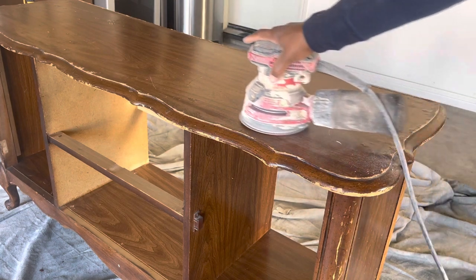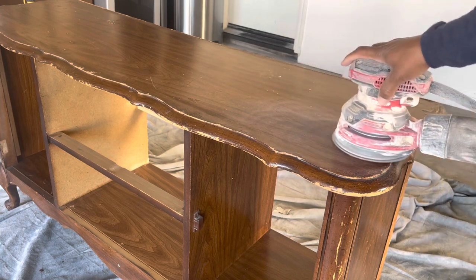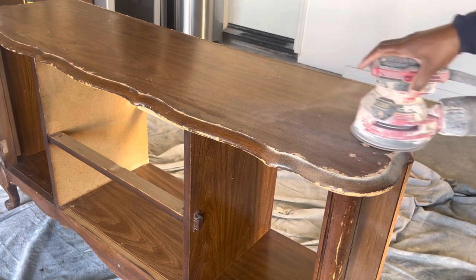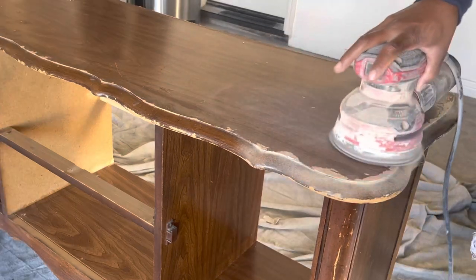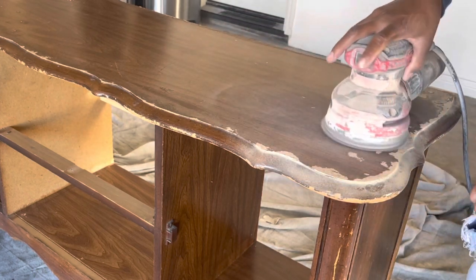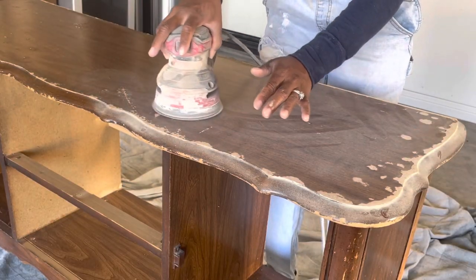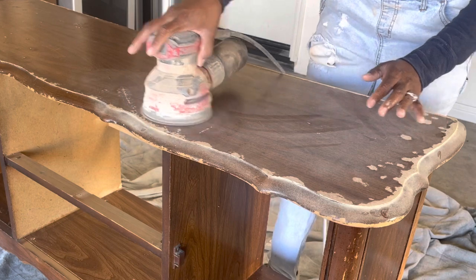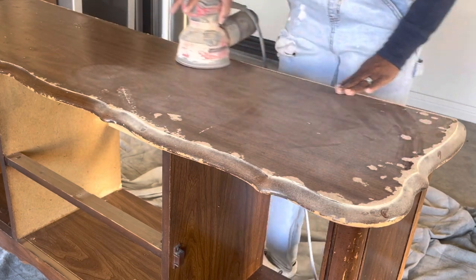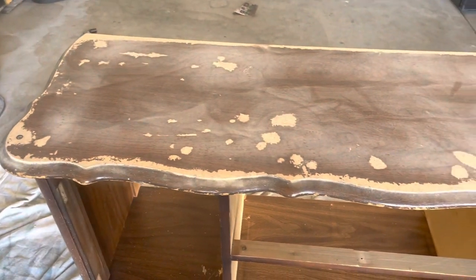So I did some research earlier this week, and I found that with water damage, you're just gonna go ahead and sand it nice and flush. Now, if I could give you any advice, I would just encourage you to just go for it. Like, don't hold back. I don't know if you can tell, but I was very cautious and I was very intimidated. I used a 180 grit sandpaper. If I could go back in time, I think I would use something much stronger, more like an 80 grit sandpaper, and I would have just went for it. But I ended up getting through it, and I had to go back and almost like double work. You'll see that a little bit later, but this is what it's looking like now.